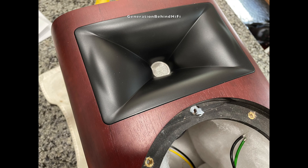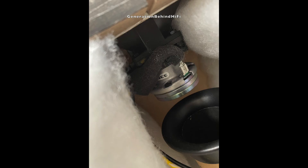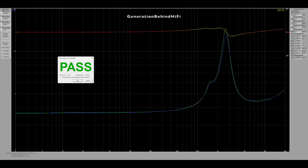Now let's take a look at the tweeter. I tried removing the tweeter assembly with the waveguide and was having the same luck as when I attempted this with my Studio 530s — I was unsuccessful. The tweeter in the Studio 630 is actually the same one from the previous model, the Studio 530. It's model number 2414H-1 and is a compression driver with a waveguide. At the sale price I paid, the tweeter is very good for what you get. The tweeter has a resonant frequency of around 2.6 kHz. Either I got lucky with the tweeters, or JBL has tighter tolerances for their compression drivers — both tweeters measured very close to each other, unlike the mid-range drivers. The high resonant frequency surprised me because JBL is crossing over the tweeter at 1900 Hz, which is quite a bit lower than the resonant frequency of this driver, but I have very limited experience with compression drivers.